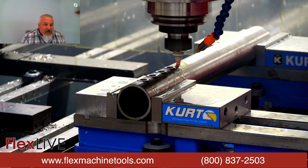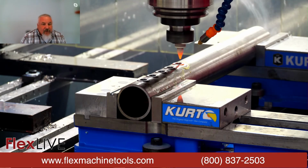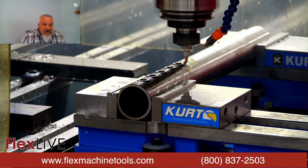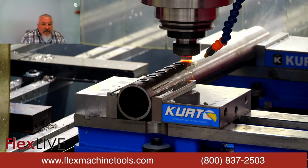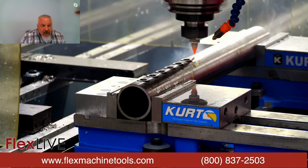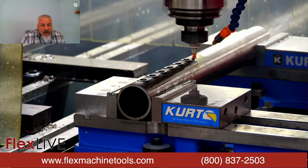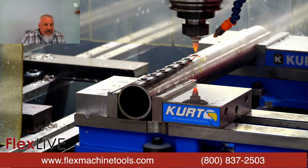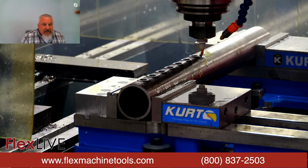We introduce it to the material, and we form what we refer to as a bushing, an extruded portion on the bottom side that you see here. As that material softens, we advance the tool through it, and that's what forms what we call the bushing. Typically, we get 3 times the original wall thickness that we begin with, and then that can be either tapped, used as a bearing surface, or used as a braze connection.